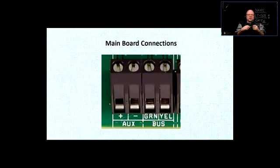How the motion sensors work, they have different ways of sensing. One of them is sensing the infrared energy. We all have body heat. We emit infrared energy, and the motion sensor sees that. It has an infrared sensor, and it sees that energy, and it's still not going to trigger, but that energy has to move from one place to another. So if there's a change in that, then the motion sensor triggers. Right? So that involves electronic circuitry to operate, and the power has to be supplied to it. So that's why we have those auxiliary terminals that supply 12-volt DC to all the active devices.